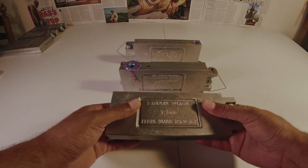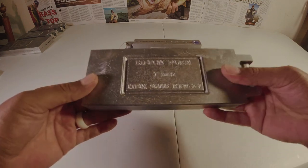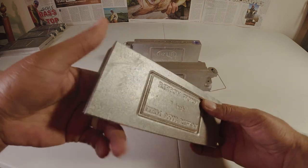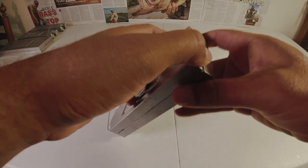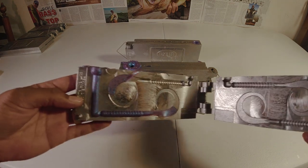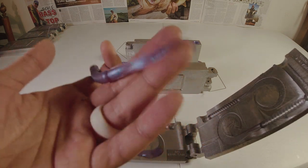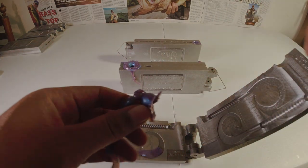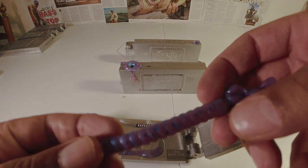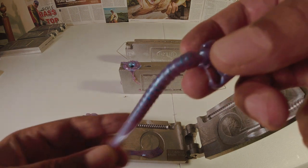Now that they've had enough time to cool off and solidify, let's go ahead and bust these molds open and see what we came up with. First I'm going to open the ribbon tail worm — this is the one I did with the Do-It injector, saying I didn't really like it because it was binding up. Like I suspected, it didn't completely fill — didn't fill all the way because I couldn't overcome that without applying too much pressure. So this will become remelt again. But looking at the surface of this, it's not horrible, but not exactly production grade.